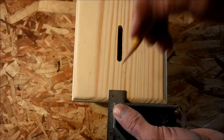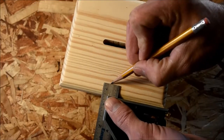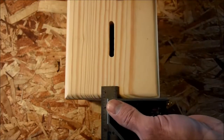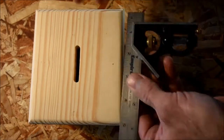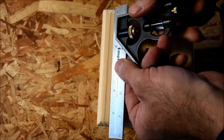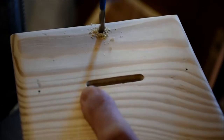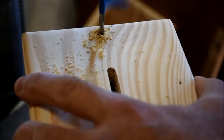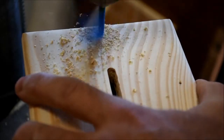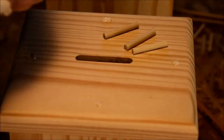On a couple of these banks I added some dowels in the top — really just for looks. These are exposed dowels and I kind of like that look. I'm finding the center of the tops along the edges and making sure it'll line up with the sides when I put the dowel in. I drill these in, add a little bit of glue, tap them in the rest of the way, and then take them to the sander to clean them off.